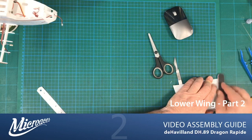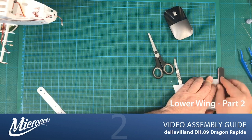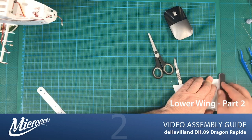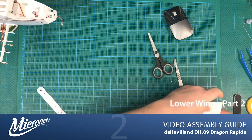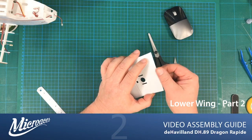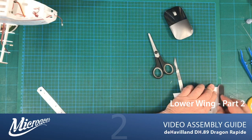And then I'm just going to gently sand that down so that I get probably around about 4 or 5 millimeters in depth of angled Depron. It also means that obviously you have a wider contact point sticking back down to the wing, which helps. You can pick it up and check that you're getting that nice chamfer in place. You'll start noticing little bits coming off like this, which shows you that the edge is being met by your chamfer. So it's a good indicator that you're getting pretty close to what you want.